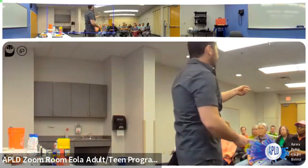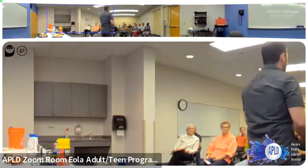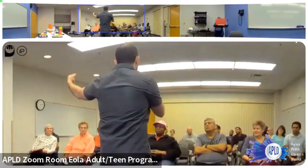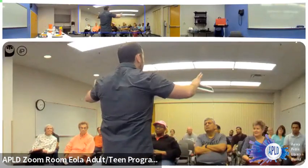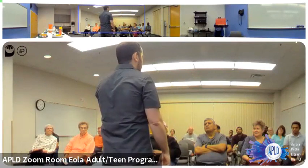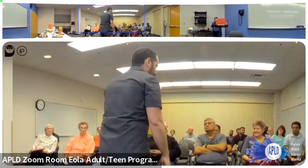And I go, ooh, there's like 18 wires back here. Now I can take this and just stick it in there. Any wire, even if the whole wire just passes through and it's completely insulated, there's no exposed metal, this will tell me if there's power running through that wire. And I want you to then find that breaker and shut that one off too. Okay? Close up, please.